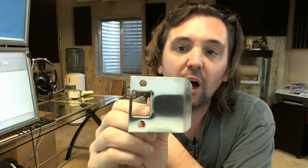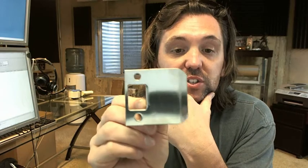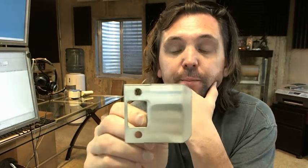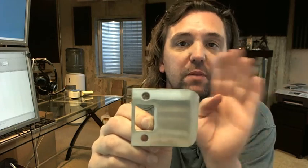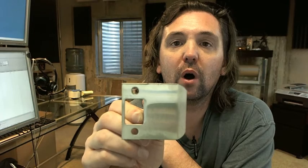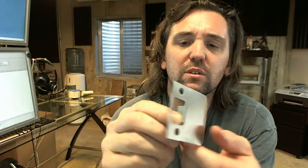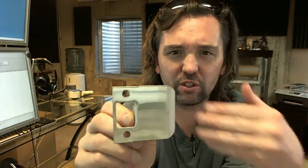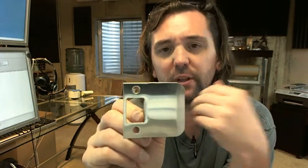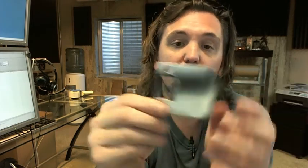Extended lip strikes are used because, very frequently, you've got a door that has thicker than standard casing installed. Pantry doors, custom cabinet-fronted doors going into food pantries, and custom kitchens with deep frames — that kind of application where the door is not installed where it would normally be installed. If your door was inset into the frame, an extended lip strike would be common.